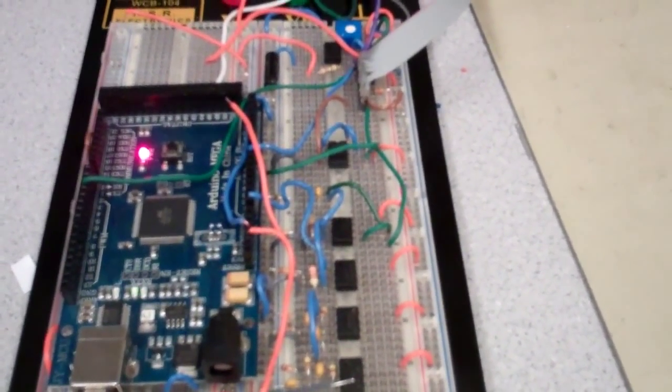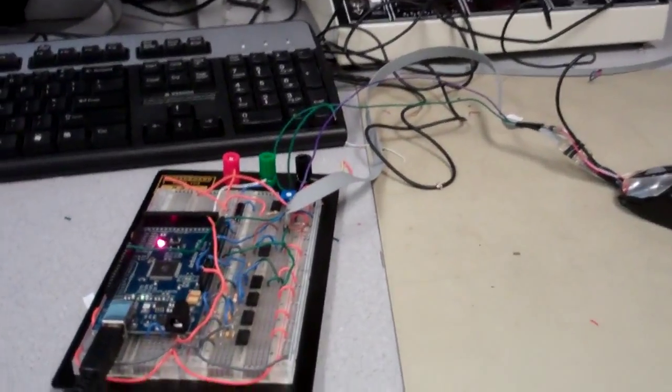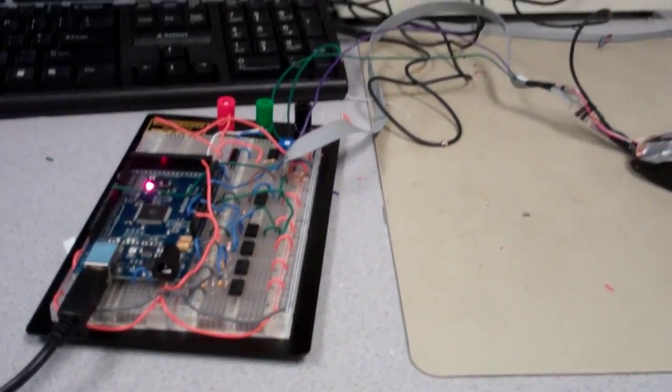And so you have the Arduino here, which is doing the A to D and the packetizing. What's all the circuitry here? You have a diff amp for the electrodes. And then we're just doing amplification. And then you also have the circuit generating the pulses for the pulse oximeter, which is a DC pulse oximeter. And then there's just a little disc motor on the inside that responds to the pulse rate.